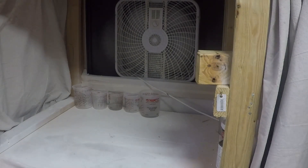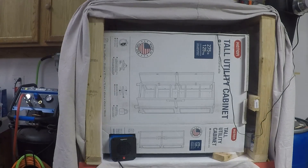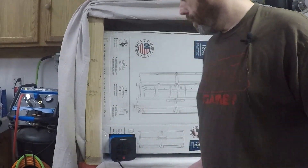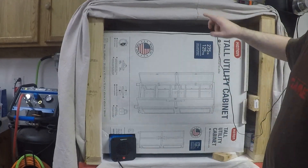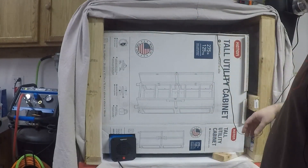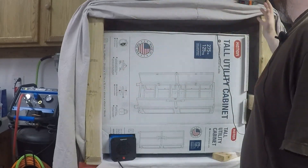And now for the magic. I've got that in the oven. What we have here, other than an obviously large cardboard box, is a digital temperature sensor in there, and I've got this cheap 500 watt heater off Amazon. I've got it up on blocks here because the fan is still going on the other side. I'm pulling air around and across the bottom to get a continuous sleeve of fresh air and remove any solvent. This is at an angle because it's blowing against the wall of the box and carrying the heat around.